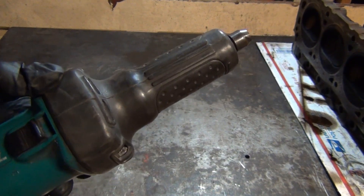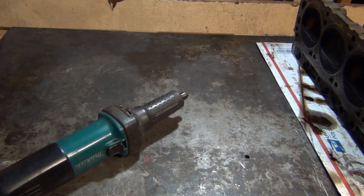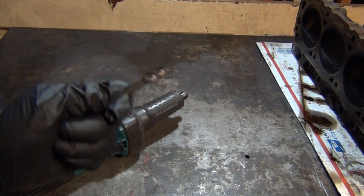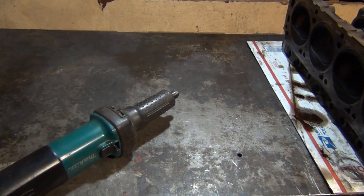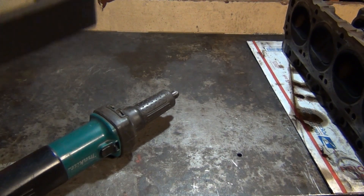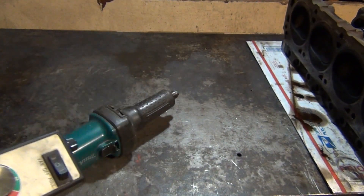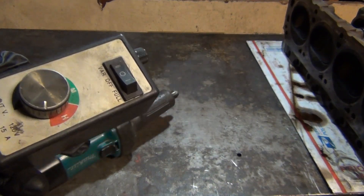The motor on these things can spin up to 25,000 RPM, while the carbides I was using tend to survive at about 7,000 to 10,000 RPM. So that's more than twice the recommended speed for them. I was sometimes wrecking these in just a few minutes. What I did to try to fix the situation is I got myself a router speed control, and this did make it a little bit better, and I was able to use the grinder as long as I have — but I just knew there had to be a better way.